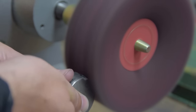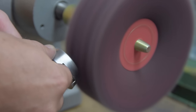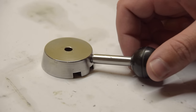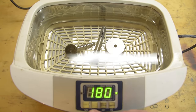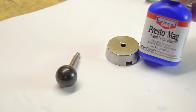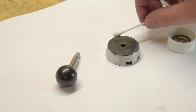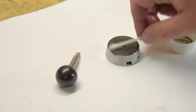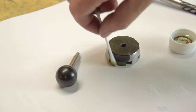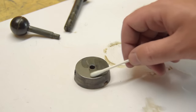But because of a little rust that I wanted to remove, I ended up stripping most of the original bluing off and getting back to bare metal. To give a fighting chance at a decent finish I spent a little more time than normal prepping the part. I don't like to blue an entire part from scratch, because the bluing always ends up patchy. The little bottles of cold blue from gun shops is not the same as the hot bluing process applied in the factory. The patchiness is always disappointing, but when the part is soaked in oil the unevenness does diminish, and once assembled on the machine the new lever will look just fine.